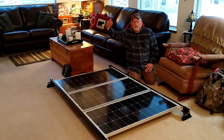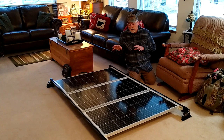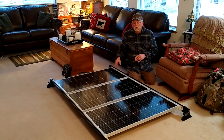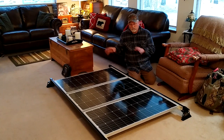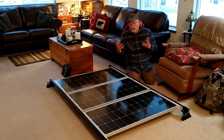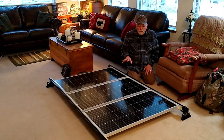The panels will be placed on the top front of the trailer. The fourth panel — I haven't decided yet if I'm going to mount it. I do have room behind the MaxFan on top of the trailer for that additional 100-watt panel, but I'm considering keeping it aside so I can use it as a standoff panel. When it's really hot and I don't want to park the trailer in the sun to charge the batteries, I can set that one panel with an extension cord out into the sun, keep the trailer in the shade, and still get approximately 100 watts of charge into the battery system.